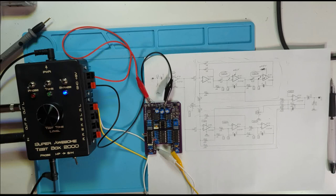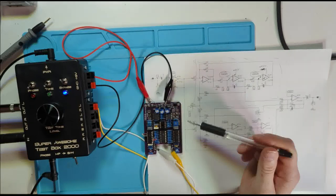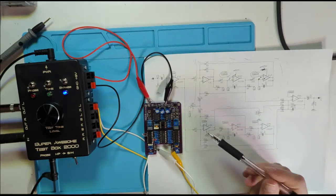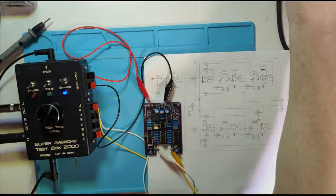It turns out the problem was that the reference voltages were flip-flopped between terminals on the op amps, making the entire configuration wrong since each terminal has a specific purpose. Once I did the workaround of soldering wires and flip-flopping them in the socket — and I highly recommend using sockets whenever working with ICs — it's now working exactly as intended. We've got this nice sweepy, filter-y goodness the pedal is supposed to produce. I ended up spinning a new board revision with those connections corrected, and on that revision I'm happy to report I also managed to solder all components correctly. Good luck with your circuits and happy building.